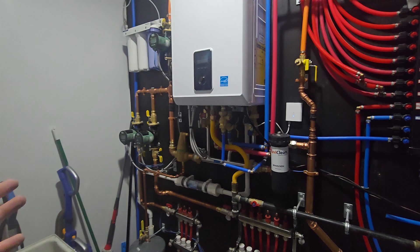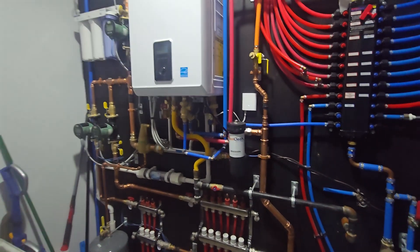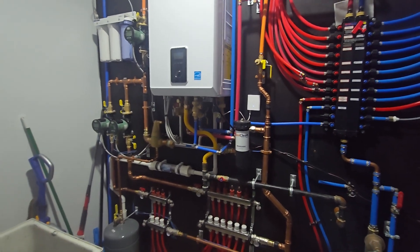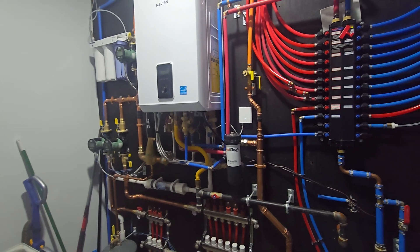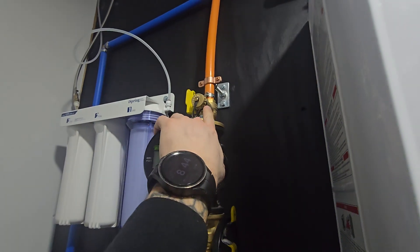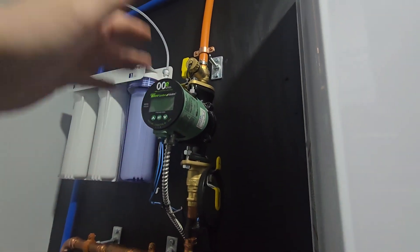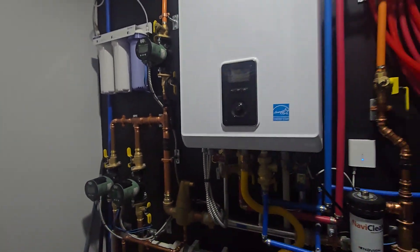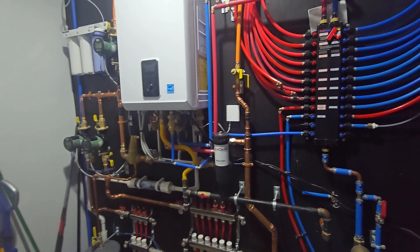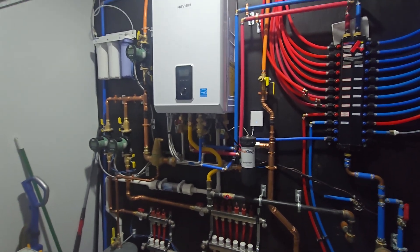There's a difference between purging the system and getting all the air out versus setting the initial static pressure. You may use full city water pressure to purge out your zones — you could actually hook a garden hose to some of the service valves on here. You could put full 55 to 60 psi on that to get all the air out of the system. You want to be careful depending on the type of heating you have, whether it's in-floor, radiators, or baseboard — all those can typically handle those pressures, but just be conscious of how much pressure you're throwing at it.